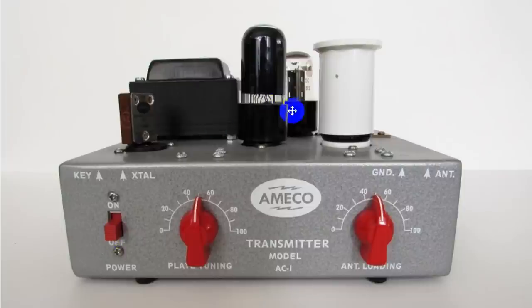Vacuum tubes usually fail at the filament, like light bulbs. The times filaments fail most are at power on and power off. So if you're going to turn this on, leave it on until you are absolutely sure you are done, because every time you power cycle the tube, that shortens its life. Replacement tubes can be obtained.